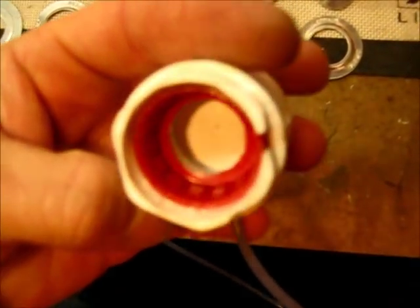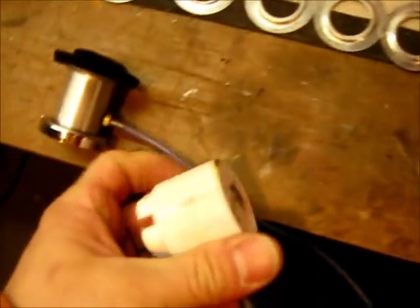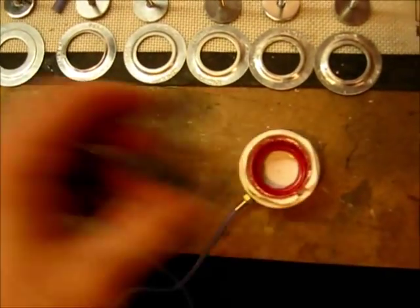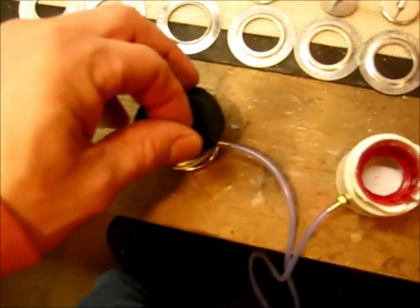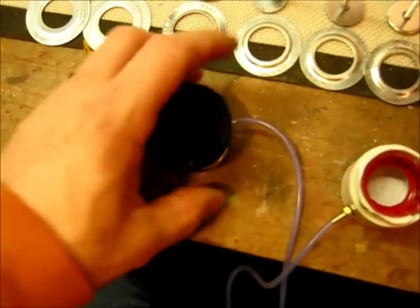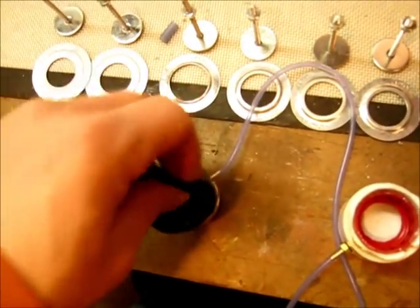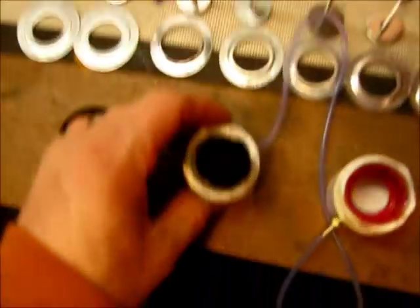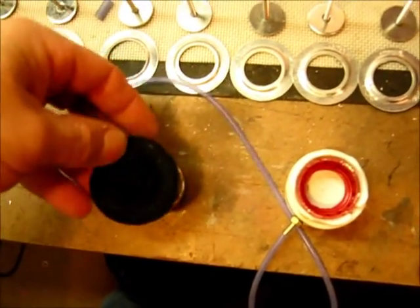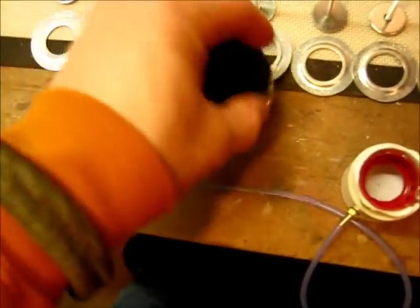This is your standard 90 degrees off with the thing in the flat bottom. I did have a little problem where I got it too close to the stove — it rolled up next to the stove and I burnt mine. I still have not JB welded this one; it's still wet from my test burn to make sure it didn't leak anywhere. The JB weld is just an additional measure — after you pound that on from the bottom and press out that outer wall, it gets pretty tight. But the JB weld is for long term because you have a steel top and an aluminum bottom, and as the temperature changes those two metals will expand and contract differently.